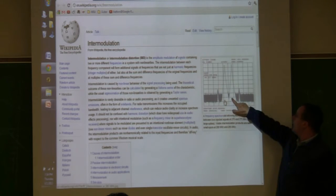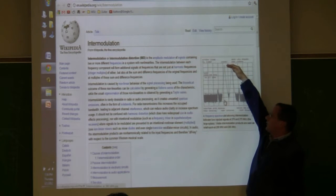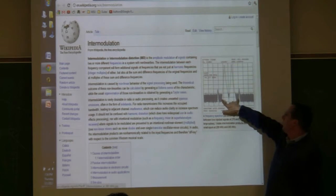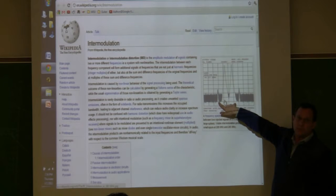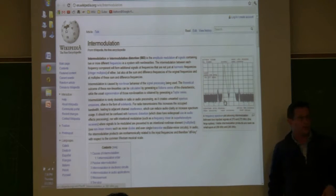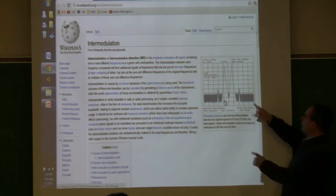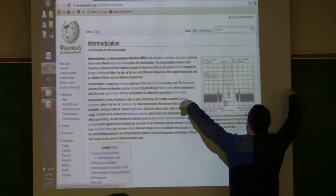What's important about this in RF is you have a transmitter or something. I have power that's associated with what I'm putting out of my antenna, but my amplifier is putting out power somewhere where it's not supposed to be putting out power. So this is important. My amplifier is doing something other than what I told it to do. And this is a result of IMD. And I have seen IMD where you have multiple spurs going out all over the place.